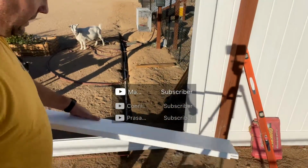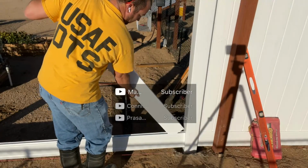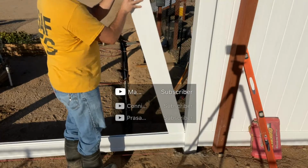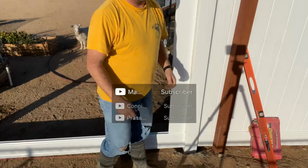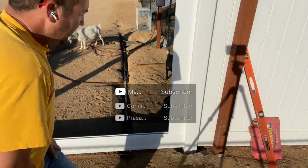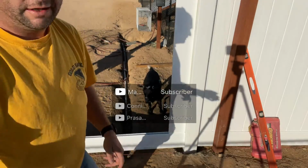So you've got the slot, the end here. Make sure to put the end cap facing the big post. Slide it all in there. Then on the top, you do this at an angle because you want to slide this up and then in. Then I make sure, at the top, to just tap it, kick it a little bit, get it in place. Okay. Now we'll just do this for all the other posts, and I'll come back to you with what we do at the end.